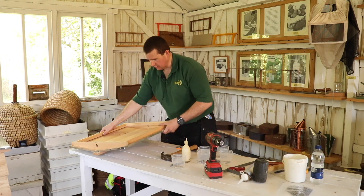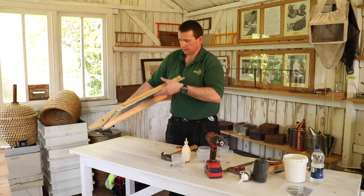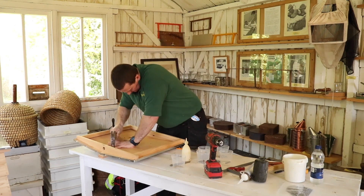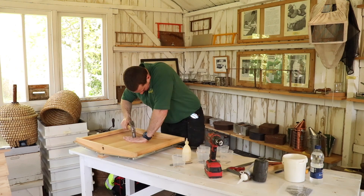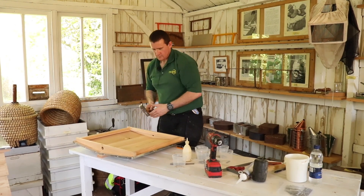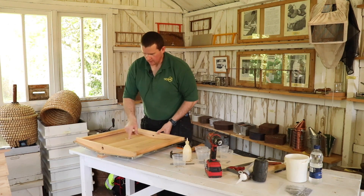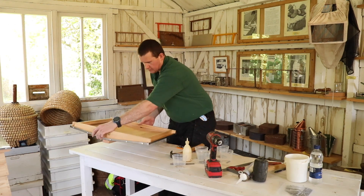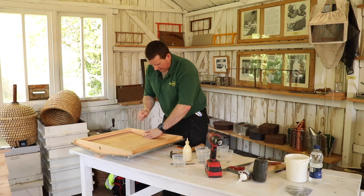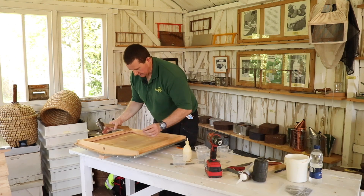That just makes sure that the tin and the timbers seal up across there. You'll notice I didn't go right to the end on this — it's because it's easier to get about halfway across and then turn it round. Otherwise, you find you're trying to hold it and hammer it here and it just doesn't work. So it's a lot easier to do it by spinning it round.